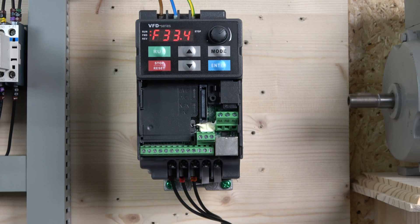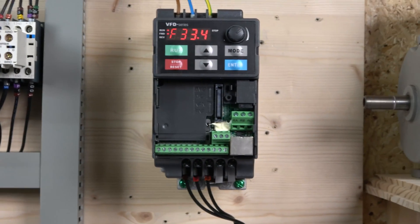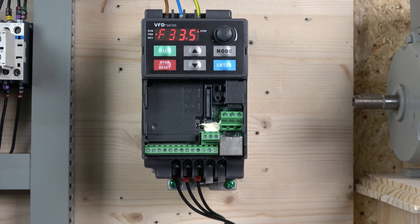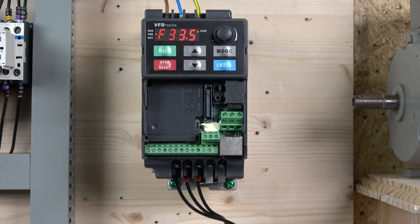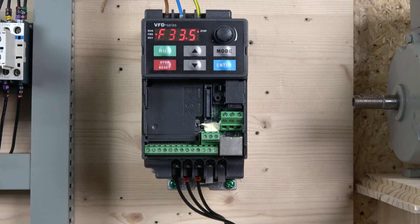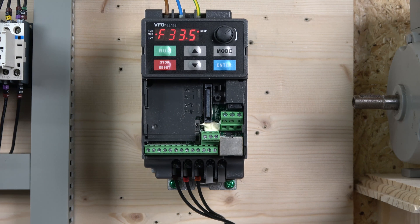If you're using it this way, make sure you have some form of e-stop functionality — either a physical e-stop to disconnect the output, or you can use an external fault input, which I'll show in the next video. Other than that, ladies and gentlemen, that covers commissioning this drive. It's a good drive, packed with everything most people would need. The switching frequency defaults to 8kHz, which I like. Thank you for watching — please like, subscribe, and comment any questions below. I'll see you in the next video.